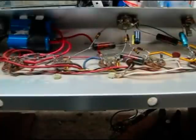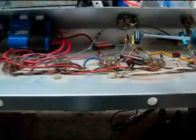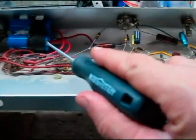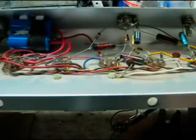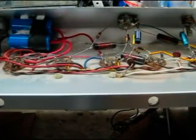This amp is done. There was a loose connection which we re-soldered, replaced a popped bypass cap for the cathode bypass and the output bias, and came up with an ugly but effective way of tying three caps together using the original mounting to get three brand new filter caps in there. This amp should be good for another 20 or 30 years. This is probably one of my favorite all-time amps for tone.